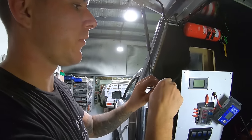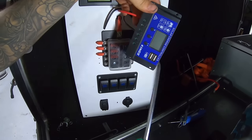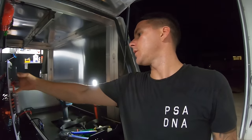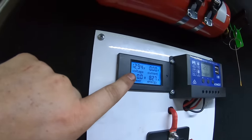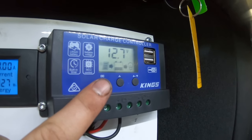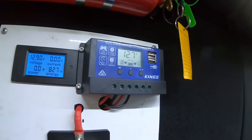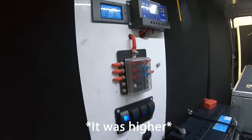I've run the wires back behind the board and took the board off to make it easier and make sure I get the wire up there. Make sure it's in the plus terminal. Make sure they're both nice and tight and not going to pull out. That should be the solar done. As you can see, we've got our lights back on. The voltage on the old voltmeter is a little bit off, which I kind of knew — my multimeter wasn't reading exactly that. But over here on the new controller screen we're at 12.7 volts, we've got a solar indicator light, a battery filling up icon, and a little light bulb symbol. It all seems to be working. 12.7 volts — we've got a full battery. Tomorrow morning I'll check it and hopefully it says a little bit higher.